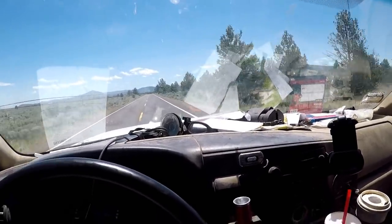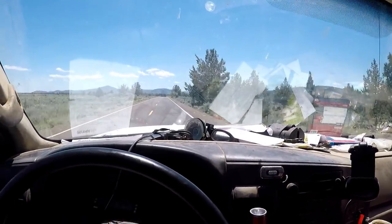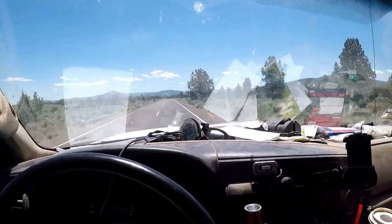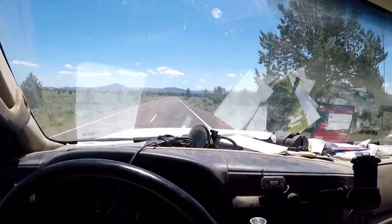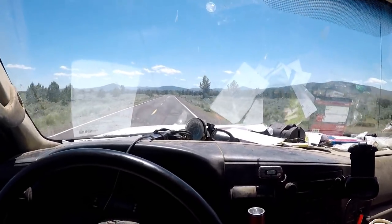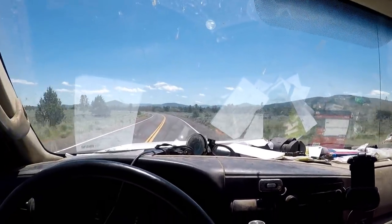But if you get one that's cracked like that, across the load sense port to a return port or something, and it dumps all your load sense pressure off that block before it ever gets back to the compensator to stroke the swash plate on the pump, it can be an ass kicker trying to figure out what the hell's going on with it. So, I did process of elimination on that one.